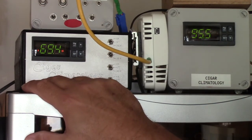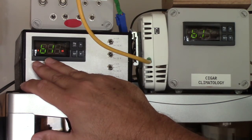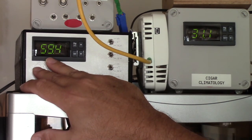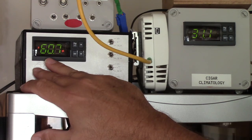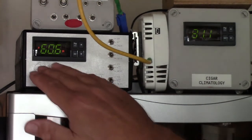After that long cooling cycle, we've settled essentially at 69.3, so we're about a little less than a degree underneath the set point. And B2 — we're currently in flux at around 60, 60.4, 60.8. As you can see, the humidifier has actually just run again to compensate back up for all of the loss of water due to that prolonged cycle.